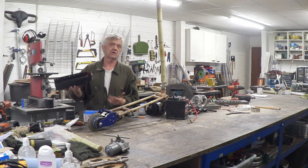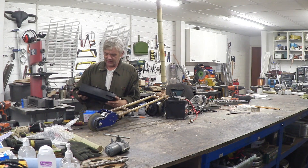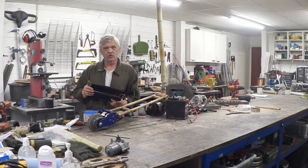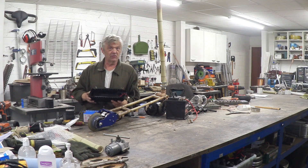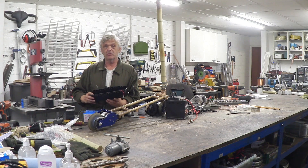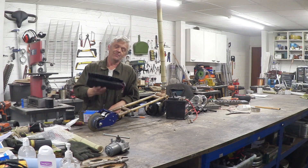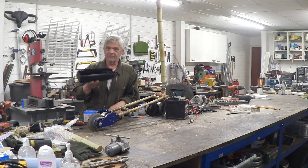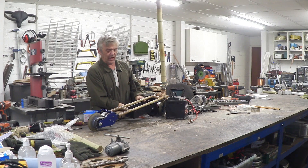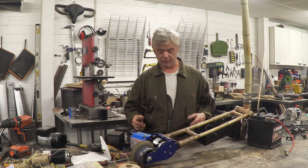If you don't have this box, you'll need to make one. This material is HDPE — you can tell just by the feel of it. You could thermally form HDPE like Luke's video shows, vacuum form them, build from acrylic and glue them, or build from wood or bamboo and screw it together. However you do it, you need a battery box that hangs under your frame. I've drilled a load of holes in the side and I'm going to stitch it on, using a couple of wires to hold it in position while I stitch.